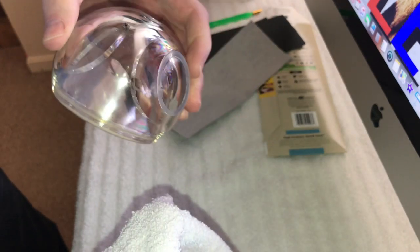Okay? Because all polishing is, is you're putting smaller consecutive scratches over deep scratches. So the deep scratches fade away because you're doing consecutive polishing with smaller scratches on top of it. That's all polishing is. And like I said, you will be surprised. It takes a couple times here. We'll get it all cleared up. And you can already look, see how it's starting to clear up right there. We're going to do it a couple more times, and it'll be looking good.